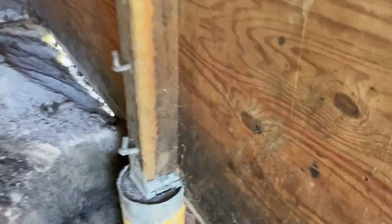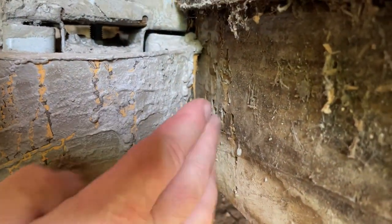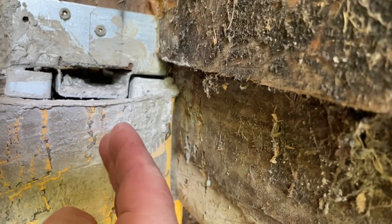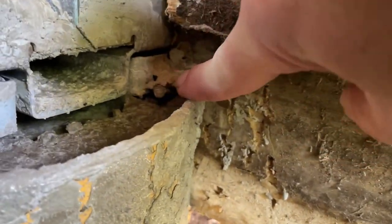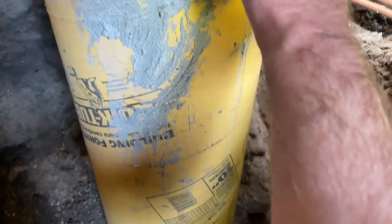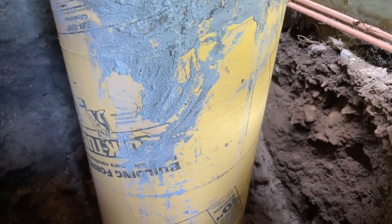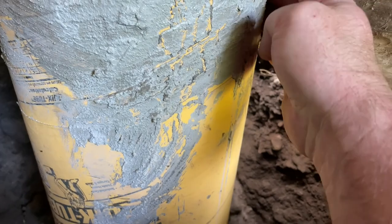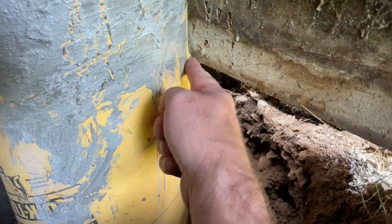Two things I learned that will be different when I do all the rest - this is my first one, my learning post, and it was the most rotten one so I started there. One thing: when I notched the sonotube, I sliced it on the outside and bent that flap inward. That gave me a little bend inside where I put a screw - you can see the screw head there - to hold the tube up off the ground a little bit to create that mushroom underneath. Once I got a little concrete poured down there I could get it level, and those wings I bent in helped keep the concrete from leaking out.